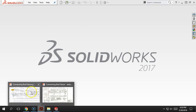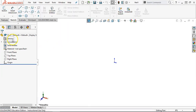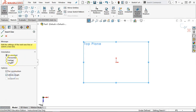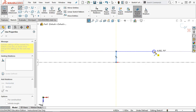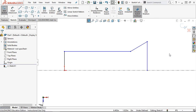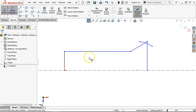I should have flown that out so I can follow the dimensions. So — part, new — and let's go into the top plane for its orientation. The part's symmetrical, so center line, infinite length, horizontal, drop it on the origin. Since this end has all of the fun stuff, I'm going to start the part at the origin, come over on the angle, up a little ways, and then back to center. That 0.937 would give me a good starting point, so let's go ahead and do a center point arc, start at the center line, and get a few more dimensions on.